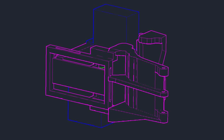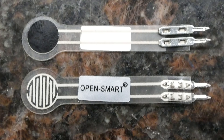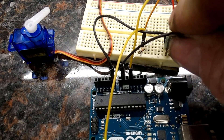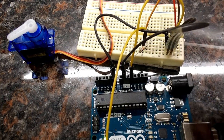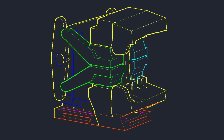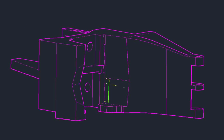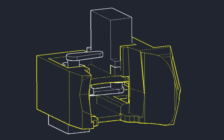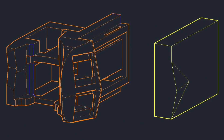The first iteration of the trigger mechanism was designed to use a pair of force-sensitive resistors to generate an analog signal where the harder you press on the buttons, the faster the controller buttons would be cycled. It was great in concept, but not all that awesome in the real world. Another change throughout these revisions was the progressive deletion of all of the linkage assemblies used to connect the servos to the controller buttons. The first version used a set of parallel four-links to translate the servo motion. On the final version, I managed to move everything around so the servos directly contacted the controller, reducing the total number of printed parts down to just two: the body and the cover.